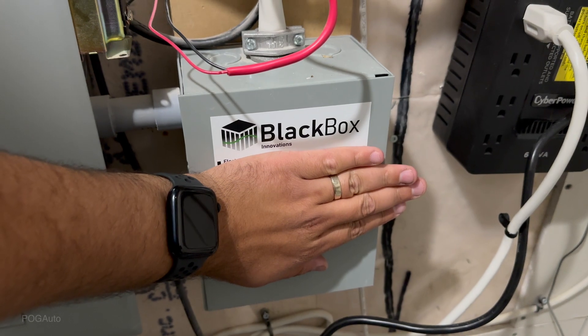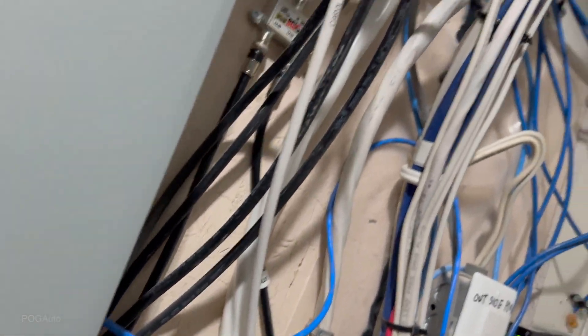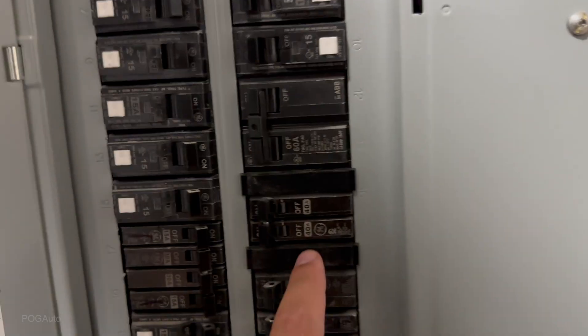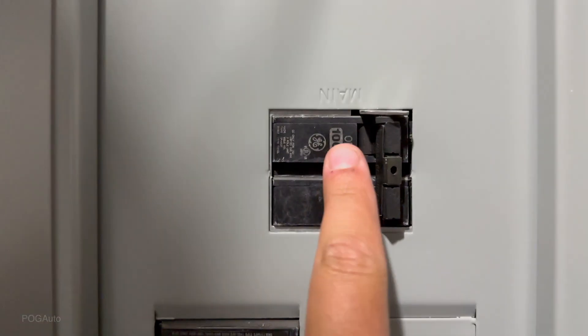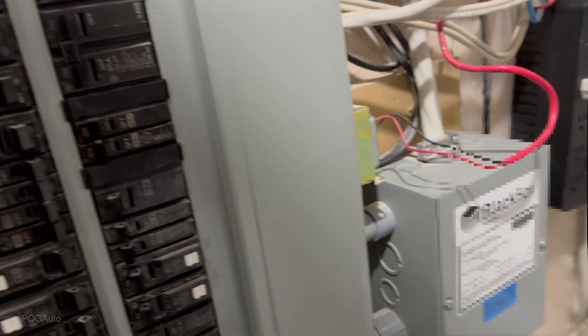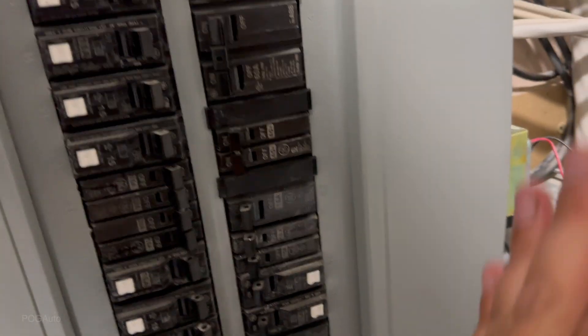Here's what the black box looks like — it's called the Black Box Electrical Energy Management Device. It's connected to the thick wire that runs to the garage. It's connected to the control panel, and inside we have our 60 amp breaker for the cars and a 40 amp breaker for the air conditioning — all on 100 amp service. When I turn on the AC, you can hear that click, which is the charger stopping. I got notifications from the cars that they stopped charging, and the breaker did not trip — all handled automatically by the black box.